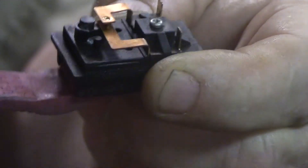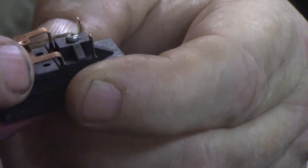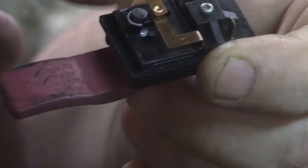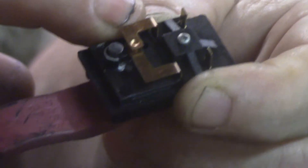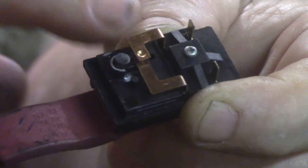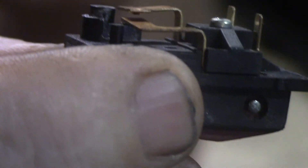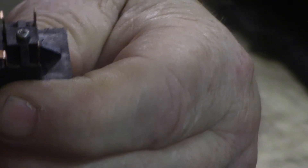This little plastic button was getting stuck. It was going up too high and getting stuck. So what I did was I bent this tab over down a little bit more. And I also bent this one down — but it's still in the same spot. It's not making contact now, you see. When I want it to weld, it won't make contact, and this button doesn't come up as high.